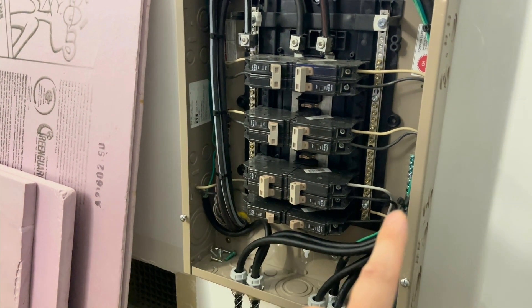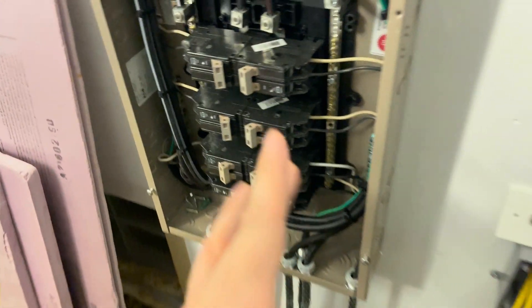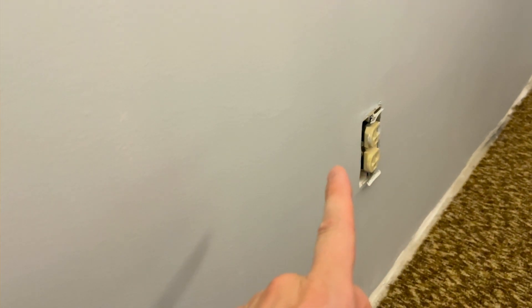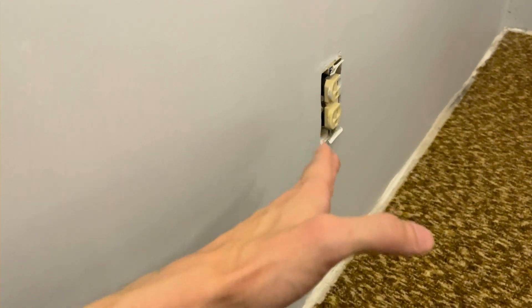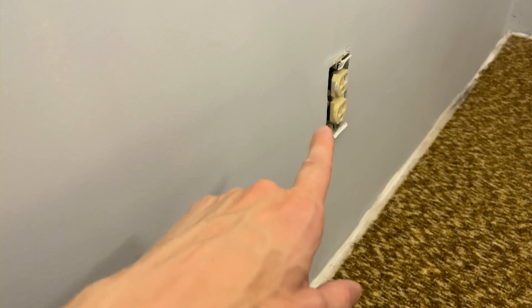I would shoot for 50 to 65% circuit capacity. One thing to note: if you are using regular wall outlets, because of the uncertainties of how these are installed, I wouldn't run any more than 50% capacity out of these. So if you think you have 20 amps or 15 amps, cut that in half and try not to run more than that out of the wall.